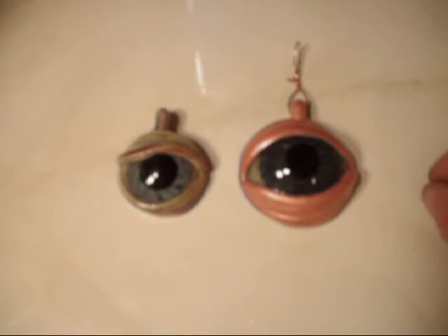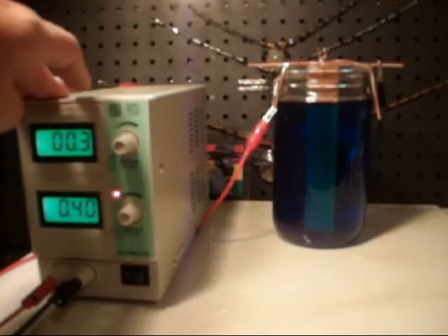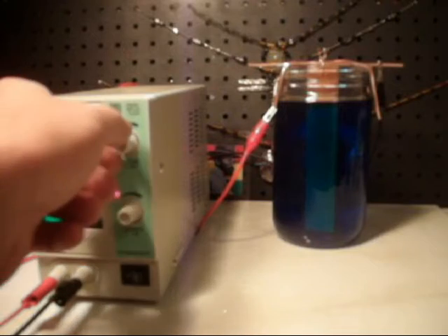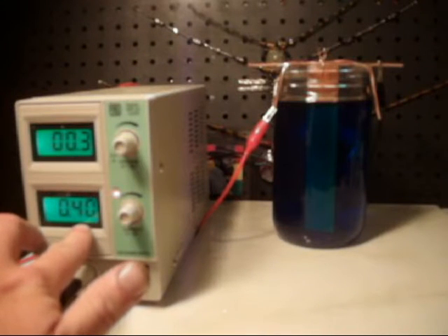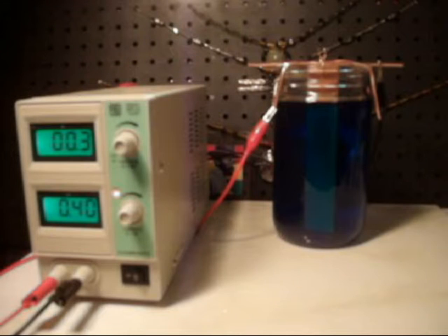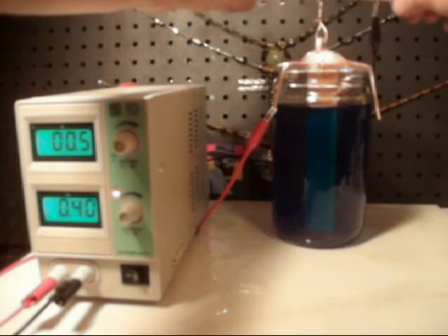And we are ready to electroform! Alright, so now we are officially electroforming. We have the rectifier set — we turn the voltage knob up here to about half, and then the amp knob is really touchy and I set it to 0.4 amps. That is because you need 0.1 amp per square inch of electroformed surface, and I've guesstimated about 4 square inches on the eyeball. If the piece starts coming out too chunky, then I need to turn my amperage down. If it starts looking pink like salmon, then you want to turn up. So I've got him in there, he's going, and we're going to come back in about a half an hour and turn up the amperage just a little bit.